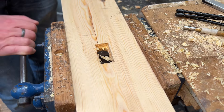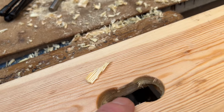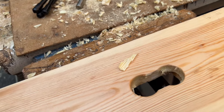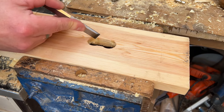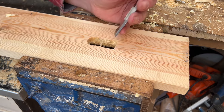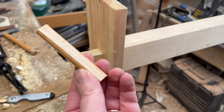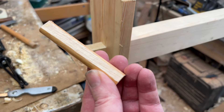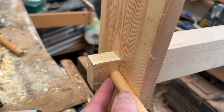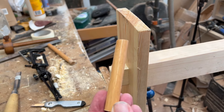Once you've cut halfway through one side and turn it over, you can see exactly where you're supposed to be chiseling to mark off that side just as accurately. With it fitting through and correctly in place, take another piece of doweling with the slightest flattened taper put on it so that when you hold it up against the hole you can mark off the very edge, and then as you bash the peg through, the fatter end wedges it in place.